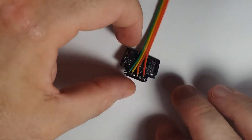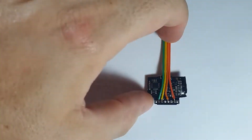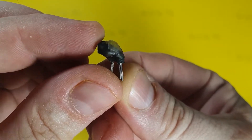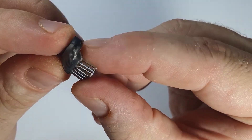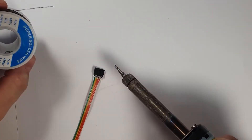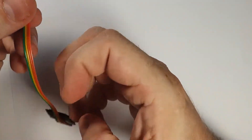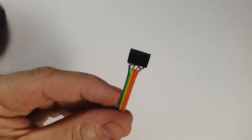I glue the cable because this is going to be the surface where I mount this board to the drone, so I don't want the cable to get loose. I take some 400-grit sandpaper and adjust the adapter because it's quite bulky, so I can close the door on the drone. I cut four pieces from a female header to use as a connector, sand that off too, and solder it to the other end of the ribbon cable. The starter unit is basically ready. I fill up between the pins with some UV resin to make sure there will be no shorts and to make it more sturdy.